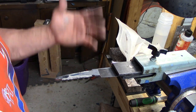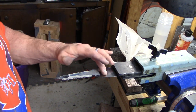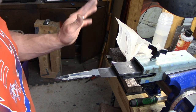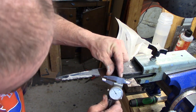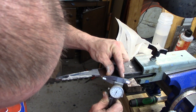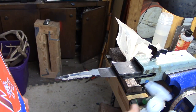This is the Bowie knife that's going to be one of my Journeyman Smith blades. One thing I'll point out is that I heat treat my blades when they're pretty thin. I don't really do a finish grinding — most of my finish grinding is just cleaning up my plunge lines. I grind really, really thin. Back here at the ricasso I'm about 25 thousandths, and out at the tip it's about 45 thousandths, which is pretty thin at heat treating.